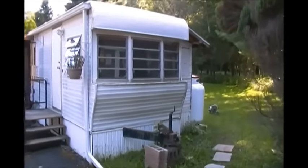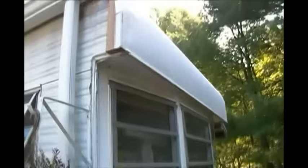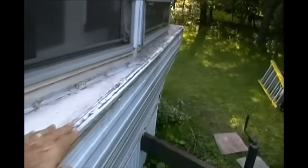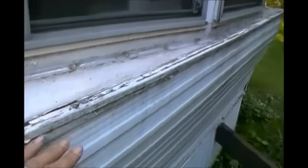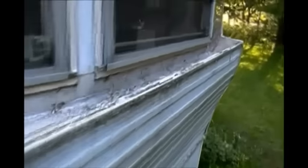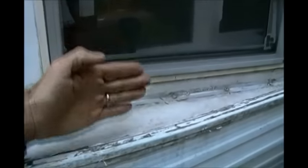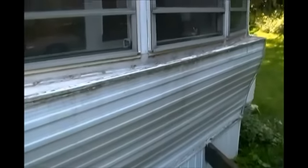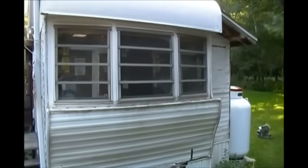Here we are from the outside - those are the three windows that are going to be replaced with two new ones. This has a serious issue with the way it was designed because they cut it back up here, but then it's also got this shelf down here. All that does is provide a place for water to collect when it rains. I don't understand why there aren't all kinds of rot and water problems here. You can see how nasty that is all the way along. What I'm going to do is frame this out all the way so it's straight, eliminate this shelf, and take these windows and move them out so it'll be flat. I think it'll not only work much better but look much better with two flat windows instead of three slightly bowed windows there.